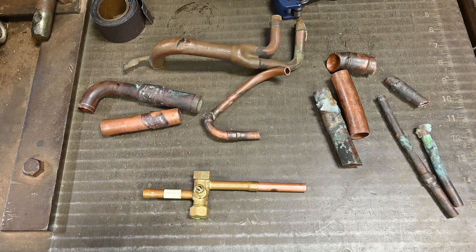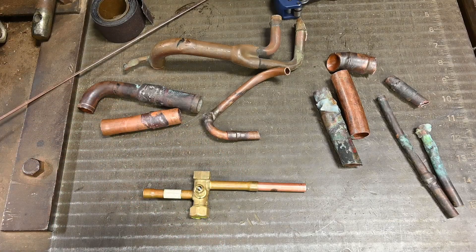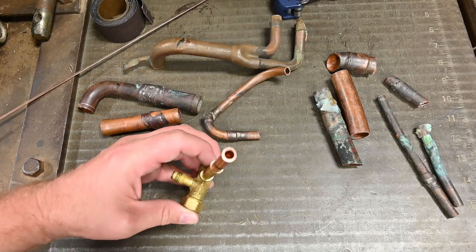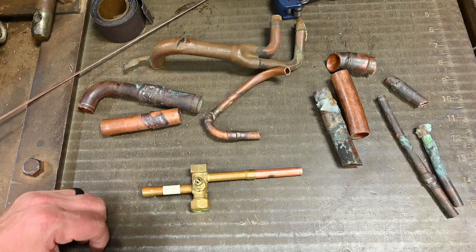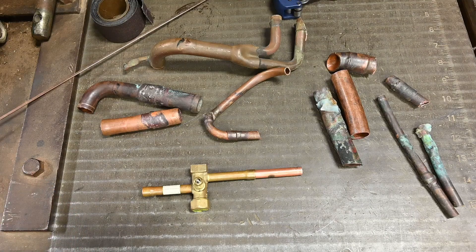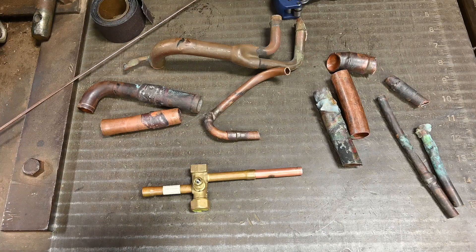It's a two-part process. While we're doing this, we have to be running nitrogen through, because as we put that hot flame in there, we end up with what we call oxidation. The oxygen from the air oxidizes and ends up flaking on the side of the pipe. That's happening on the outside, which we don't really care about, but it'll also happen on the inside, and that oxidation on the inside clogs up TXVs, screens, solenoid valves, and all kinds of stuff in the refrigeration system. So we want to run nitrogen through — just a very small amount, not even a PSI — while we're brazing, and that prevents oxidation on the inside. I'll link a video in the description so you can see what brazing looks like with versus without nitrogen.